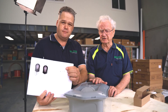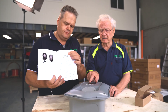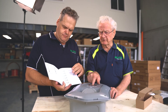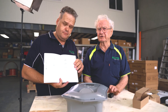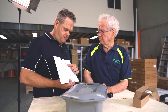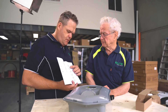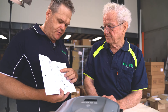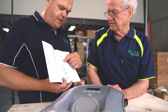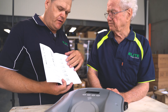What I do like about the Zappi is it's got a very good graphical interface. The user interface has little pictorials of the house, the car, the grid, etc., with power flows shown in real time. At a glance you can see exactly what's happening with the system. It's got little words in there that tell you what's happening - that's a surplus situation there where you've got surplus power being produced, the house is using some, and then we're putting some into the car using the surplus.